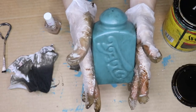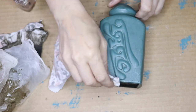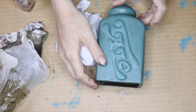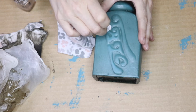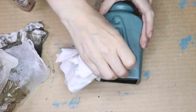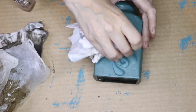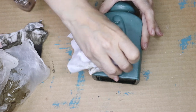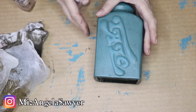We'll let this dry overnight and come back to apply the final step, which is a clear coat. I'm going to take a clean rag and wipe the letters of the talc container a bit more to make them stand out. I took my gloves off for this because the glove was reapplying the stain back onto the piece. You should have wiped enough stain off to hold it with your bare hands at this point, but check the areas you're holding to make sure they're still in line with what you're looking for.